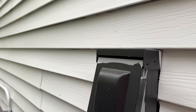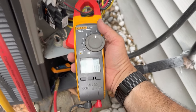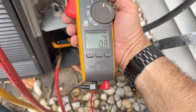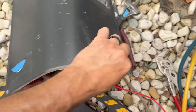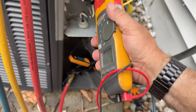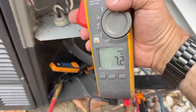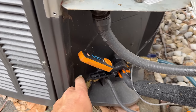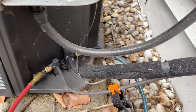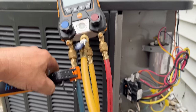Let's see how our amperes are. 1.9 there on our fan, which I think is about right. I've got to peel off stickers — thanks a lot. He's got the same name as me. 7.2 on the compressor. We're sitting fairly decent. We'll go ahead and get off of this thing. I have a feeling it's going to get ready to rain, so not a whole lot of riding in the Jeep as much as I wanted.